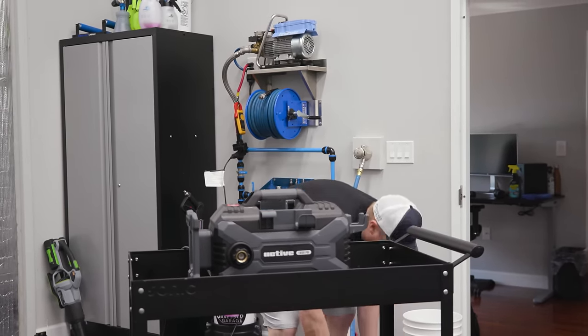So, crap, what was our math? Chris, I know our grit guard wasn't in here. We're going to lose a little weight with that water. Let's see what our weight is here. We don't have the scale, it went in the auction. That's 18.44 pounds. So I think it was 8.32 pounds per gallon of water, minus the bucket. So it was 18.44 minus 2.3 pounds, divided by 8.32, is 1.94 GPM.